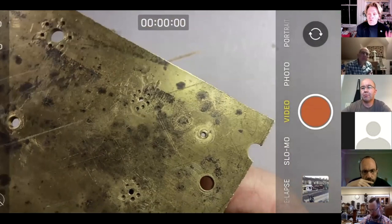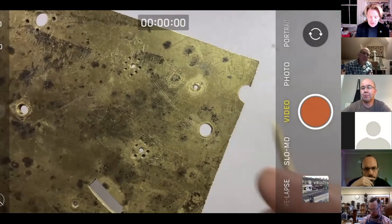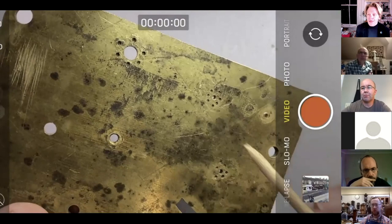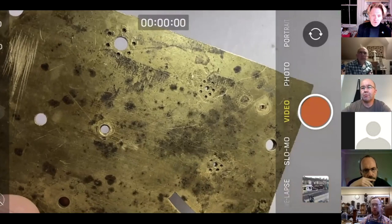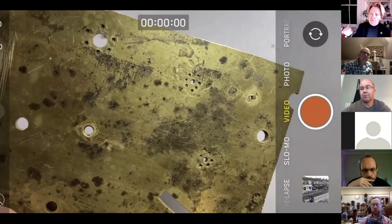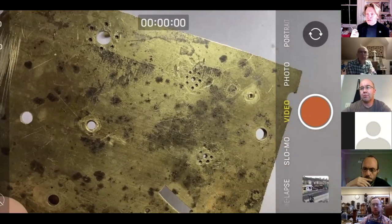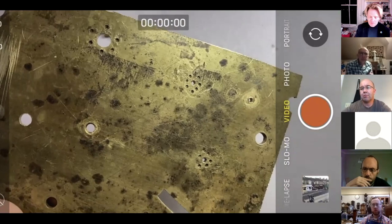I can't remember what I said last week about cutting the oil sink, if indeed there is an oil sink. Maybe this is something we can cover in future sessions, because clocks like this, if you look at these pivot holes, which have been punched up, as you can see, if we get chance after the pinion removing demo, then we will talk about oil sinks. But these holes didn't have oil sinks, so you tend not to make them again. But if you're going to make an oil sink, for instance, in a clock that has one, do it before you do the final broaching to open up to pivot size. Otherwise, you'll get the thing running fine for your pivot size, then you'll do the oil sink, the oil sink cutter will burr the metal, and then the clock won't run properly. So do the oil sink first, then the opening up, and then the deburring that we talked about last week.